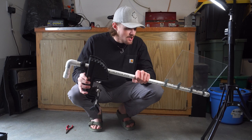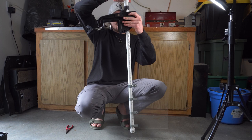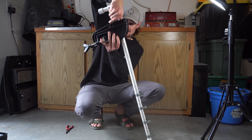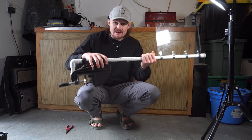Here is our finished prototype. If this were on the boat, this is how it would be situated — this bracket screws into the boat, we can turn it a little bit as needed, and then going down we have our rudder in the water just like that. Obviously when pulling up to land, we'll need to remember to pull up the trolling motor and also grab this and pull it up so it's out of the water, hanging on the back. The nice thing is it's detachable, so I can take it on and off on each trip.